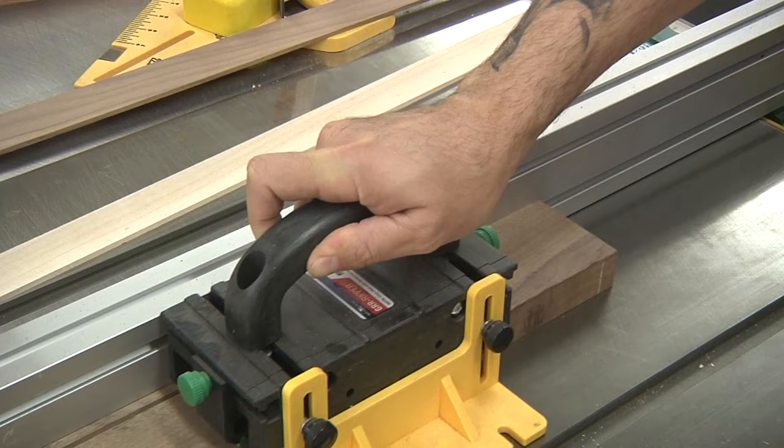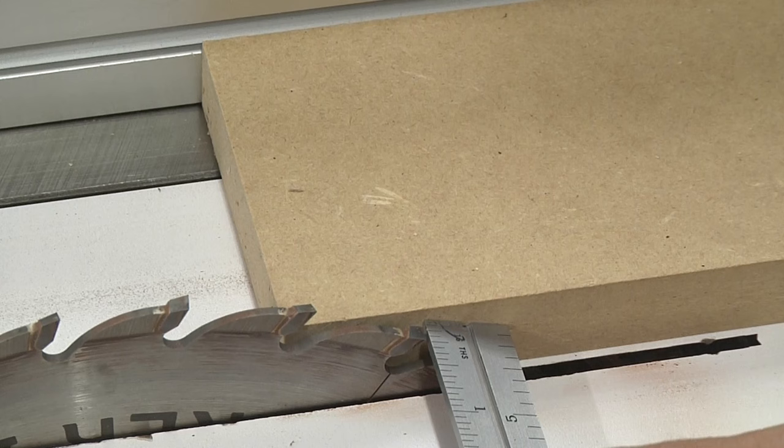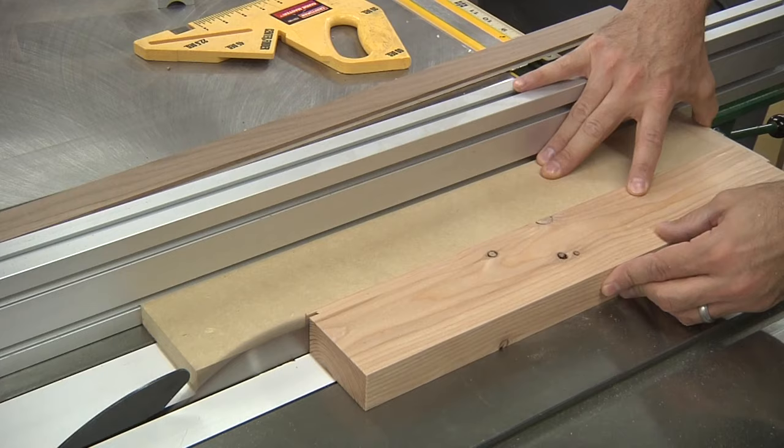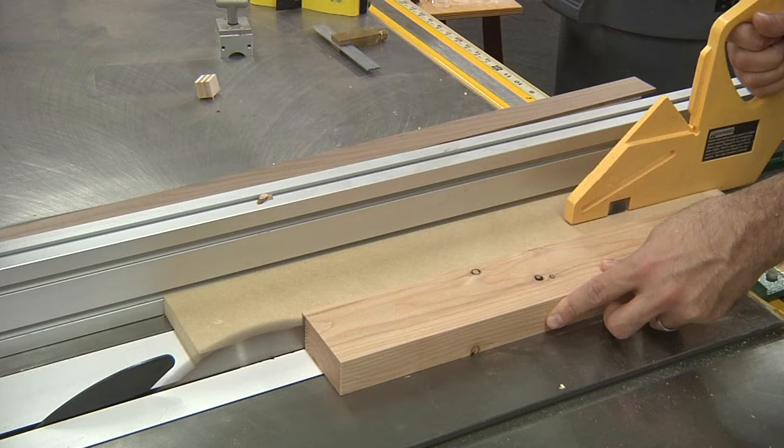The second option is a very simple jig made from a small piece of sheet goods with a small hook glued onto the end. Set your fence so that the jig sits the desired distance away from the blade and lock the fence down. Now place your work piece against the jig and carefully make the cut. Even though we cut away some of our hook, there's still enough to do the job on subsequent cuts. This method is great for shorter pieces but gets a little bit dicey on larger ones.